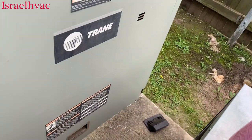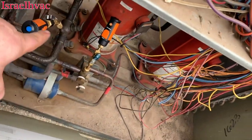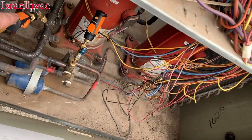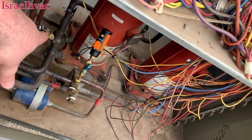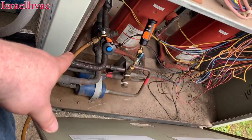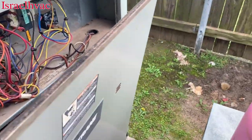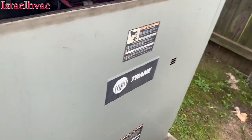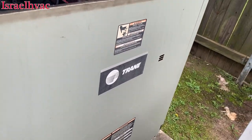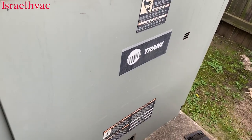Here's my charging setup. You can see right here I have the pressure probe, a valve core tool, and then a Yellow Jacket ball valve. My hose goes in the side of the core tool, and there's my high side. As you just saw from the screenshot, we drastically lowered the superheat, but we still didn't gain any sub-cooling.